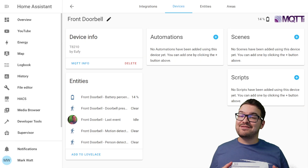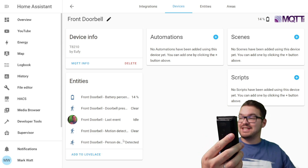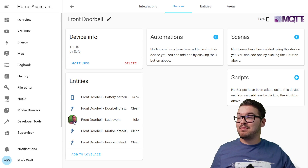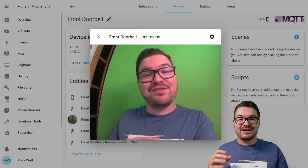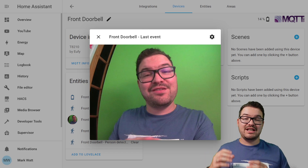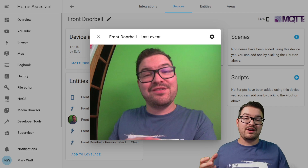If you want the sensor to stay on longer when a person or motion is detected, just update that number. Let's give the test a go — I'm going to pick up the doorbell now. I'm giving it a little wave, and I can hear the camera clicking in. The light has lit up, and I can see that the motion and person detections have kicked in. The image won't auto-update here so I'd have to refresh the browser, but if I click it, I should have an image of my face — and based on this image we're going to say that was a success. The person detection wasn't the quickest — there was a couple of seconds delay — but it's probably quick enough for triggering a script or an automation.